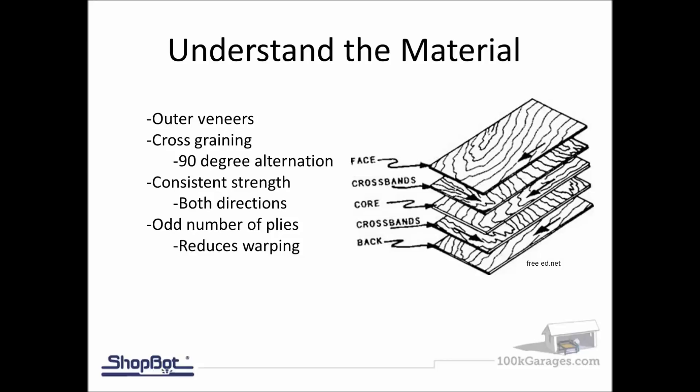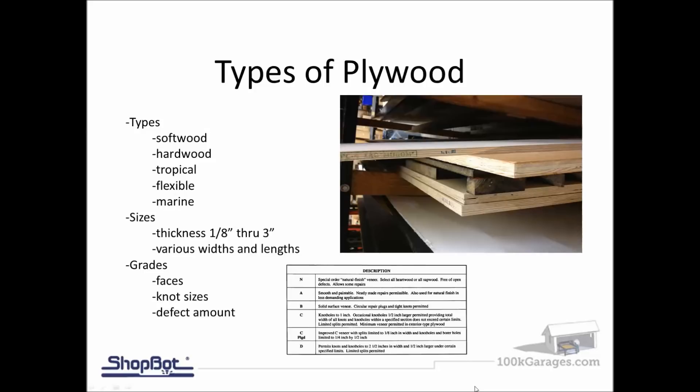There are different cross bands and core that go in the middle of the plywood glue-up. Typically the face grain and the core are your structural pieces, and the cross bands aren't as strong. So if you're going to use the plywood for something structural — say a chair you're going to sit on — any parts that need to withstand weight, you want to match those with your face grain. Like many other forms of lumber, plywood has a rating, usually stamped on one of the edges.